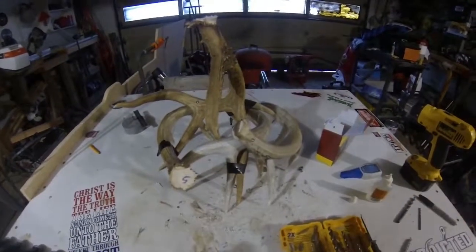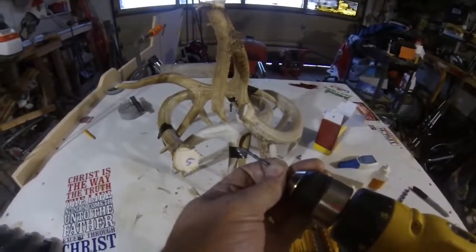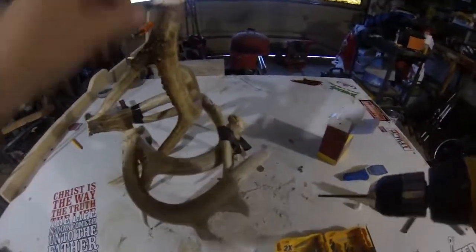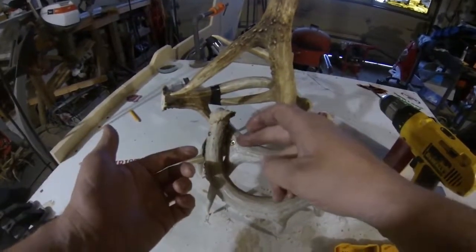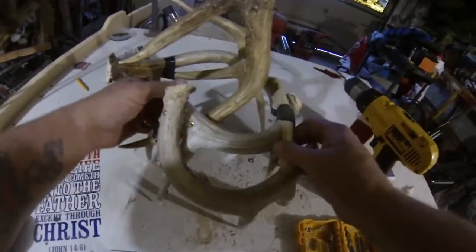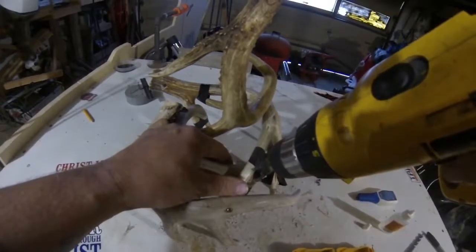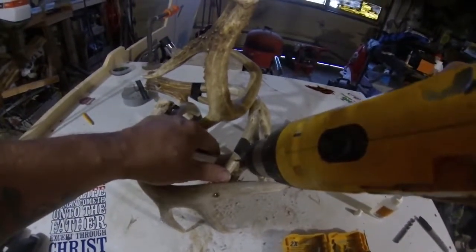Once you find out your drill size, you get it out and pilot drill through first. Go ahead and knock one in here. You can see all these that have been drilled. I pilot drill them and then I countersink them and run the screw in. You want to drill in, eyeball a straight hole, and intercept it where it's all touching together. So right there would be really good, just driving it in right there. And don't put your finger right behind it and don't drill through it. I've almost done that a time or two.